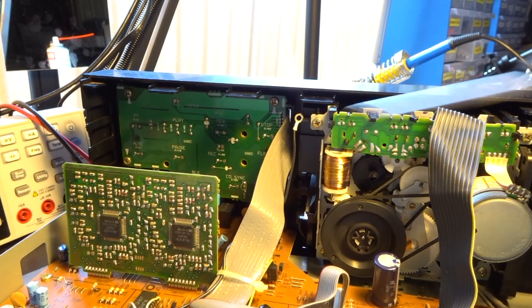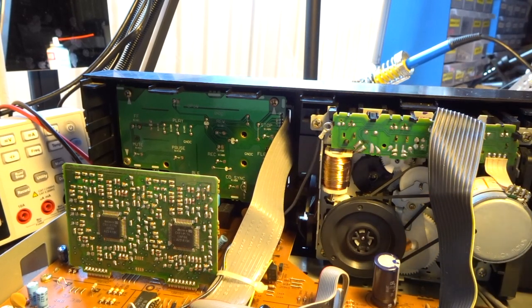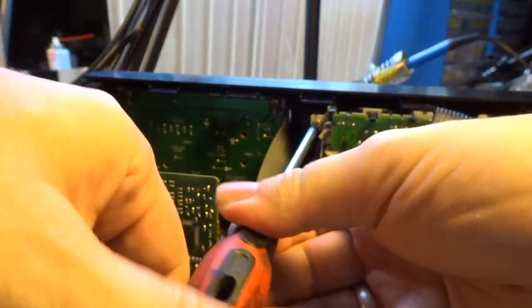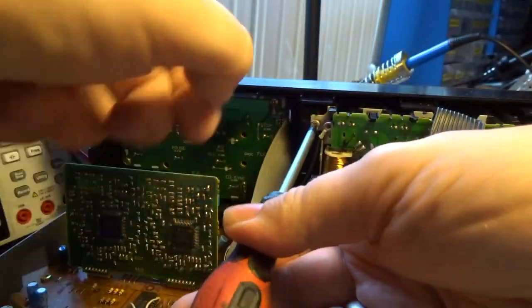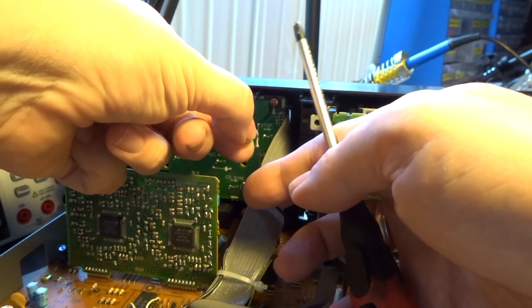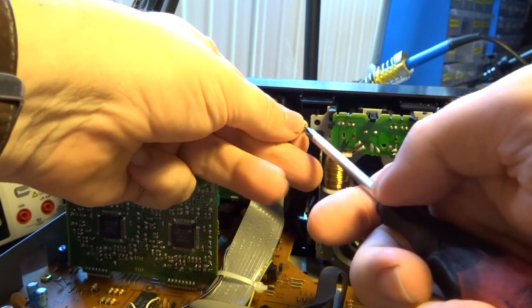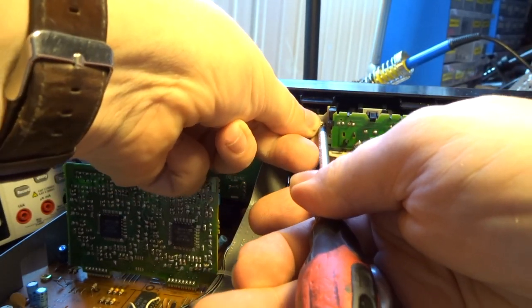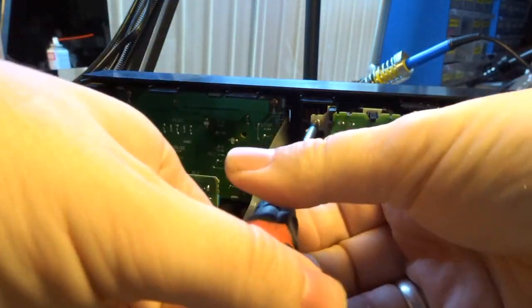But the reason for the problem was found quickly. I forgot to put on the grounding wire onto the transport. So when you experience this kind of issue, check that the grounding is there. Attaching the grounding wire again to the transport resolved the problem, and finally I could start doing the recordings and capture the different results from playback.